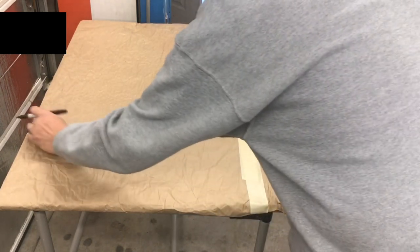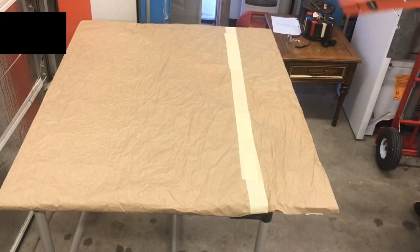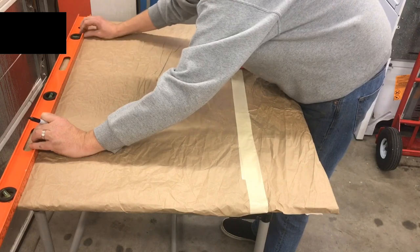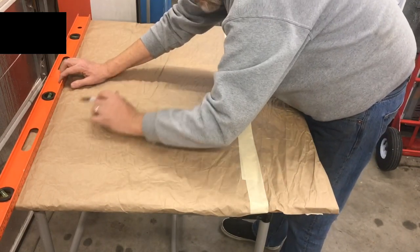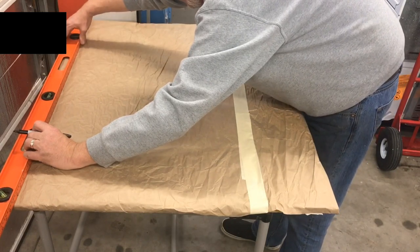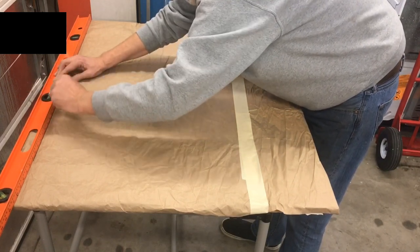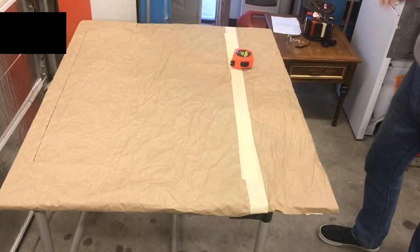I'm going to come up here. Since this is my straight edge, I'm going to put a mark at two on each side. Then I'll take my level and set it on those marks. This is 40 inches, so I'm going to come in five inches and make a mark here, then from there come over 35 and make a mark. I'll come across — so now I have my back line, 30 inches across.